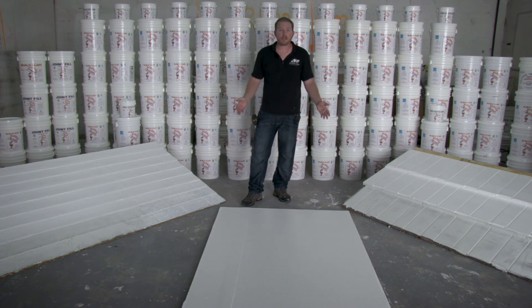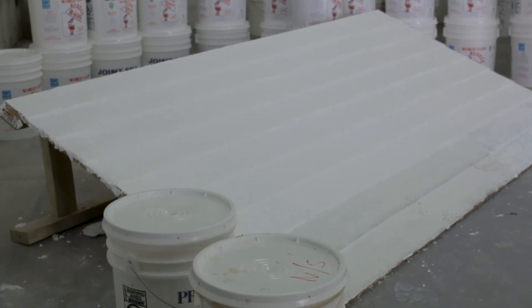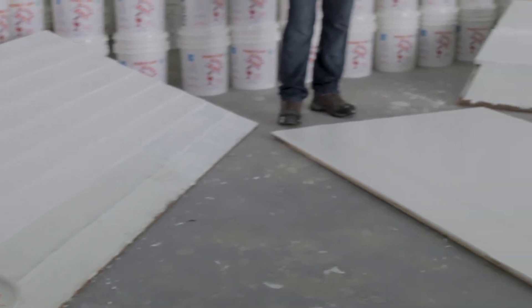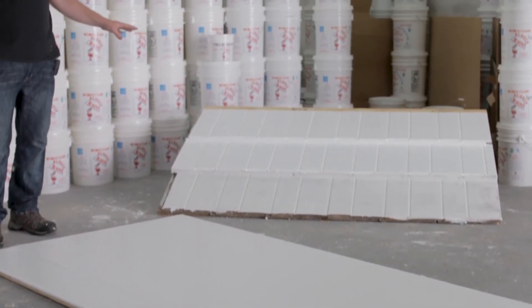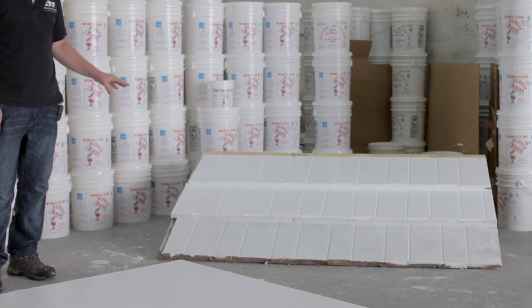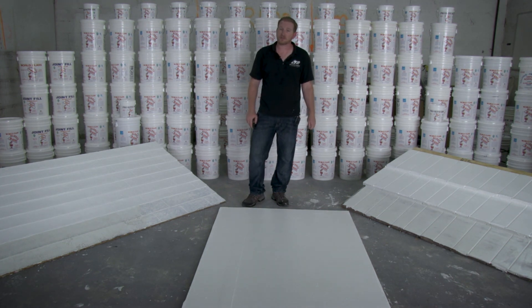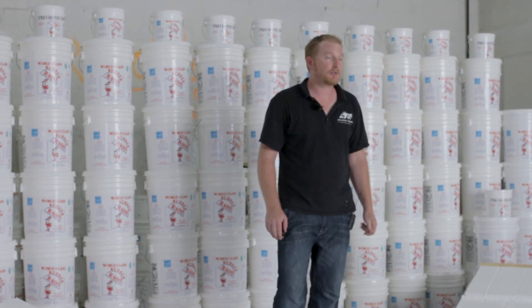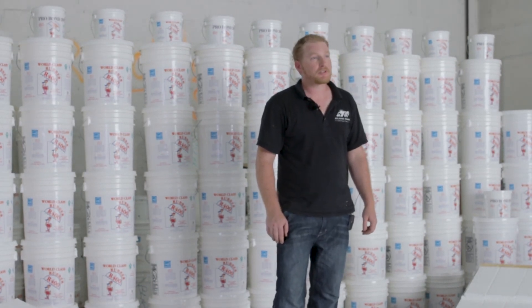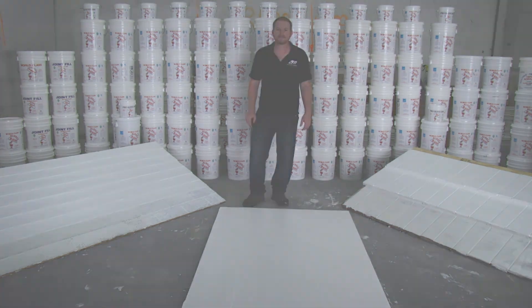That finishes up our installation video for R400 rubber — a great product for all different types of roof coverings. It can be installed across a shingle roof using Portland cement slurry or joint fill compound. It can also be applied across a modified bitumen roof with or without polyester membrane depending on standing water. It can be installed across a tile roof covering, which would need a slurry mix if it hasn't been coated already. Each job has different prep work needed, but R400 is a great solution across all roof types. It's also going to keep your home or business much cooler and be very resistant to mold and mildew buildup. You can keep your roof under warranty forever with it — why re-roof when you can waterproof?